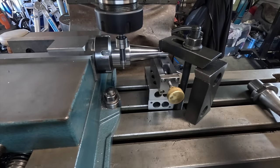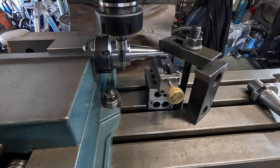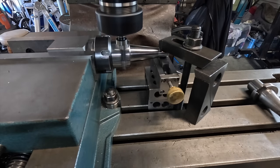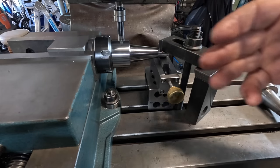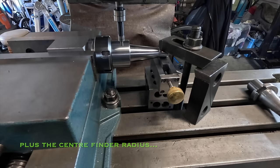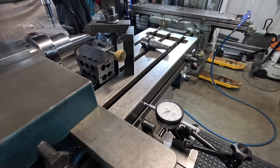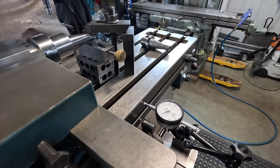Let's go back to basics now. Sort of got used to having a DRO. It's on the Cincinnati, but that's no more. Shift over 23.84, which is half that diameter, and I can put a 5/8 cutter up then and put the slots in. Another thing with this mill, I can't believe how light the knee is to wind up and down compared to the Cincinnati.